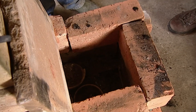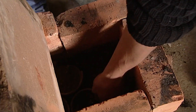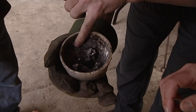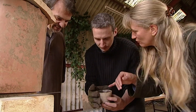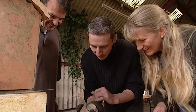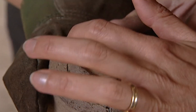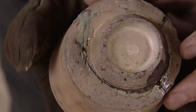In our Roman workshop, today's the day when we try to enamel our Roman brooch, and for that we need some newly created coloured glass. Hey, look at that — you can see the copper on the surface there, the pinkish stuff. That's copper metal, it just appeared spontaneously. That's a strange sign — not necessarily what we want. See how this is green on the underside? That's actually the glass from the pot coming through the crack. It's just leaked all the way in. That's a nice greenish colour, isn't it? It's beautiful.